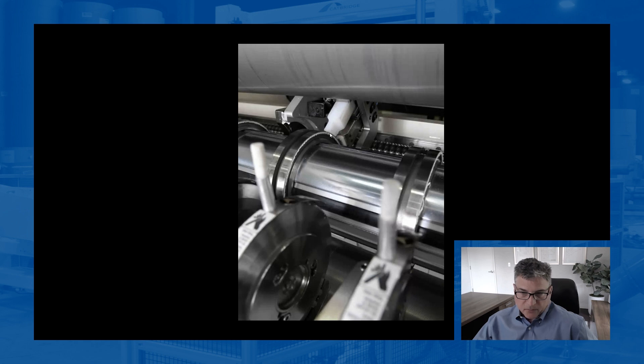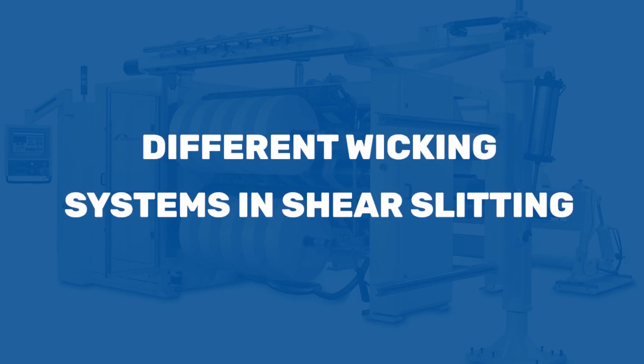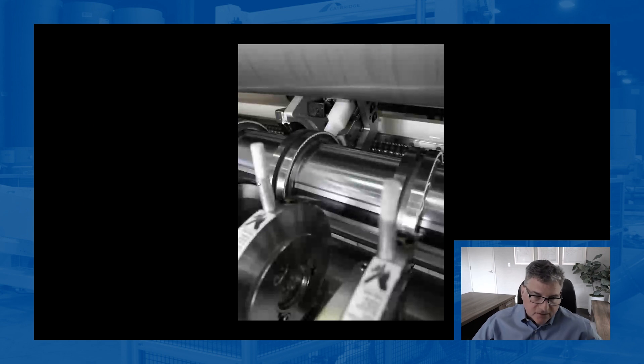When slitting adhesive products — primarily label stock — there's a layer of adhesive between the liner and the substrate. That adhesive can build up on the blades and it's problematic. This picture is showing adhesive rings. What we do is build in wicking systems. This is a very simple wicking system for label stock — just a round wick that squeezes around there. Customers lubricate them to keep the blade wet. On our auto positioner, we also have a wicking and scraping system on the female side that wicks and re-lubricates all the active knives.